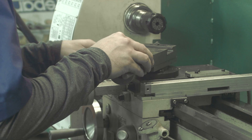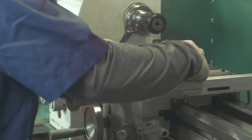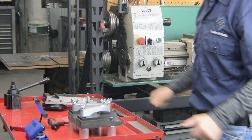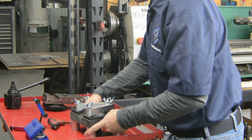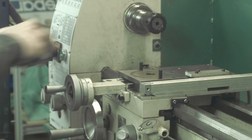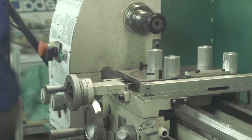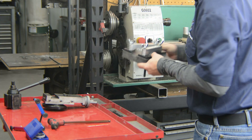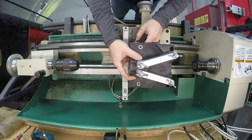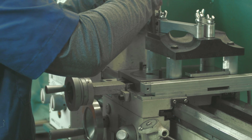The castings need to be machined and we decided to do the machining on the lathe. In order to machine the part on the lathe, the compound had to come off and in its place a 3D machined fixture is bolted to the cross slide. This part needed to be drilled to the proper tapping dimension, and our small mill did not have enough z-axis height to hold the drill and part with the necessary clearance. Machining and drilling on the lathe solved this problem — our lathe has 22 inches of z-axis movement and the mill only has 13. We treat the lathe at this point as if it were a horizontal milling machine. An ER32 collet holder is used in the spindle for holding our tooling. The setup is very rigid and works well.